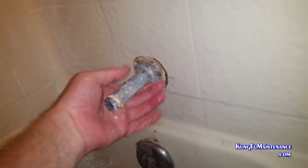These ones use a half-inch nipple that extends out from the insert in the wall. This one had to prove whether or not it was just leaking from the front or whether it was leaking from the back as well. That's what holds the tub spout on — it just threads on. Some of them are soldered on or glued on, other ones use a push fitting that pushes on. It wouldn't have been a bad idea to just replace the tub spout, but was able to reuse the old one.